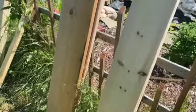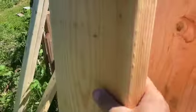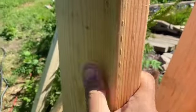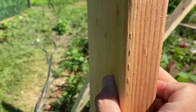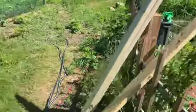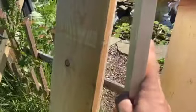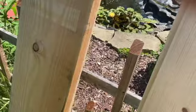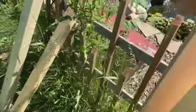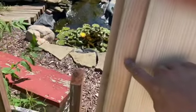For this horizontal hive I'm going to be using two by 12 material. I'm going to use two-by because it's inch and a half thick true thickness, and that is going to insulate a little better than three quarter inch, which is what most of the existing hives are. On the inside I'm going to have three quarter material to line the inside — it'll sit slightly less when it sits inside, giving a little bit more insulation — and then my frames will rest on that.